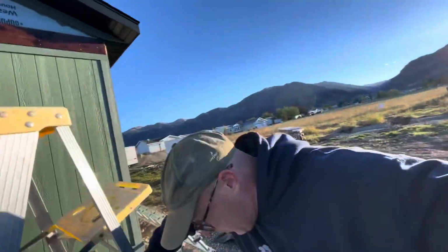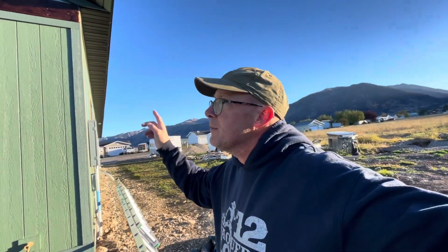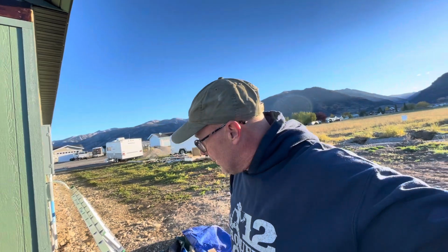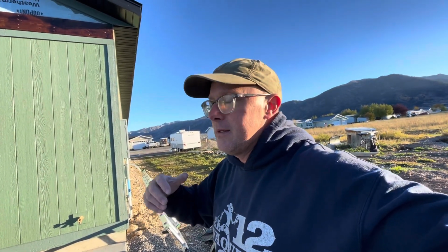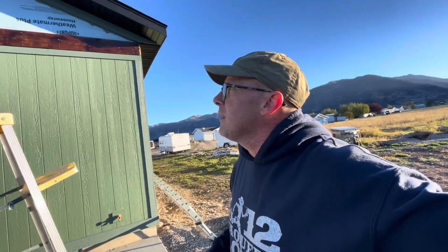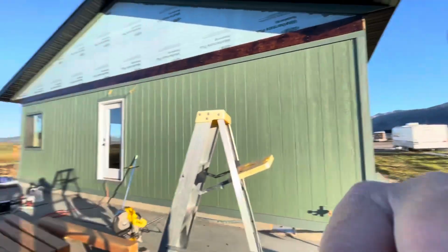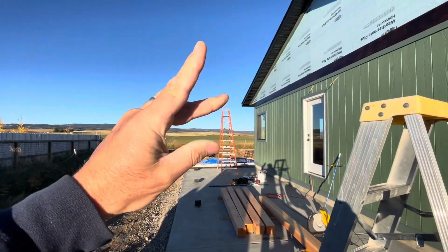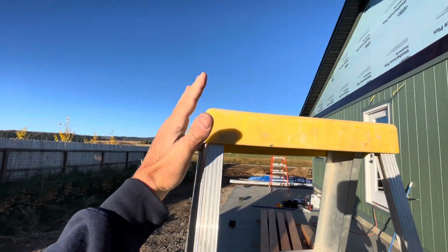And our builder friend, Greg, who built that house and then came over for about 5 or 6 days and helped me set the trusses and do the finish up on this for the framing, is coming. I just wanted a knowledgeable extra set of hands. Even though I built this over there twice, I had both my boys, who I don't have, to help me. And I want to do a bird's mouth cut on these rafters, so when they come down, they're not just sitting like this on the edge of the beam with hurricane ties holding them to the beam.